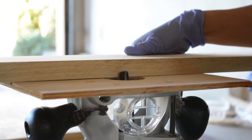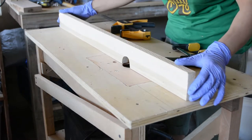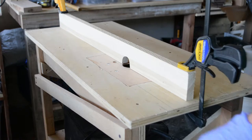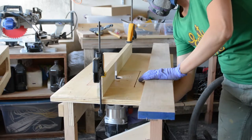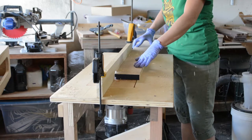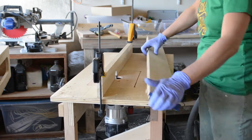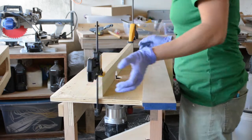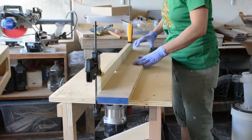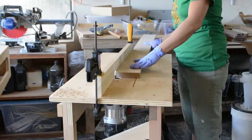I'm going to cut out the groove in the back of the shelf with my router and an up-spiral bit that goes about halfway up the thickness of the board. In retrospect I wish I'd only gone up about 40 percent or less of the thickness to leave more room for the hanger bracket holes I'll drill later. With the router seated in the table and the fence in place, I plan on cutting the groove in two passes — cutting half of the width each time. As I begin making the first pass I find it's difficult to push the board through, so I adjust the fence to make a shallower cut. Ultimately I want the groove at least a quarter inch deep to have enough space for an eighth inch thick mirror and an eighth inch thick sheet of plywood.